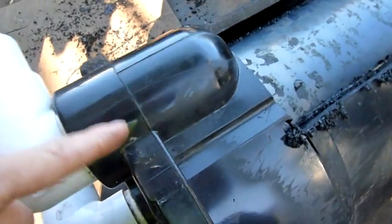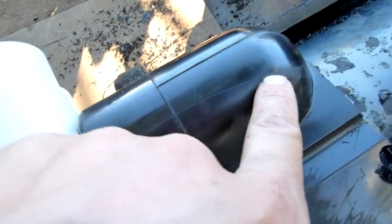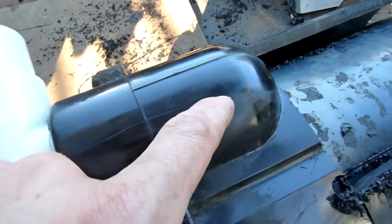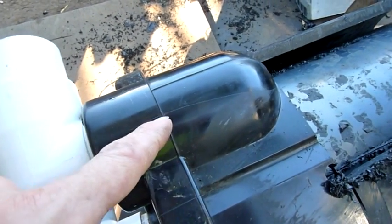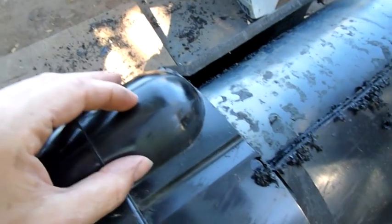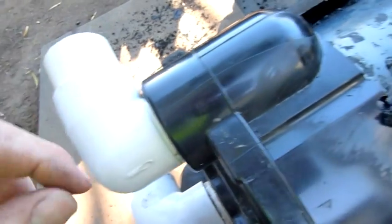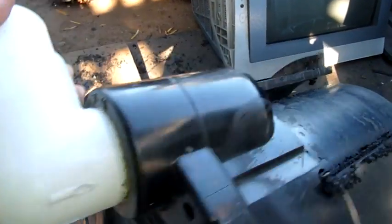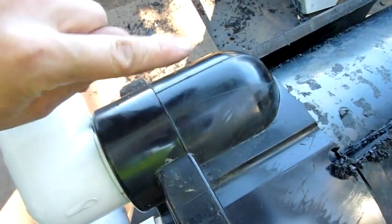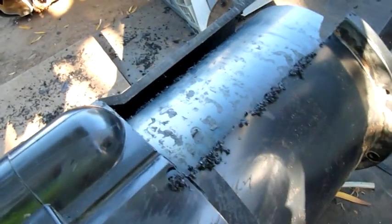Well, this just got more interesting. I had to re-look at this because I realised the adhesive had come down from here where they've glued the fittings in. Here's the crack coming up through there, but it's got rounded edges on it. I looked at it with a magnifying glass and it's not a sharp, fresh plastic crack — it's actually a cold flow. An injection moulding flaw where two flows of material coming into the die meet up but only partially bond. It would have bonded enough to pass pressure testing, but this plasticiser has found it out as a flaw, in combination with attack from the adhesive.